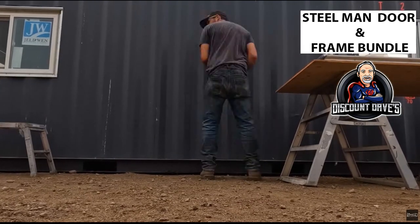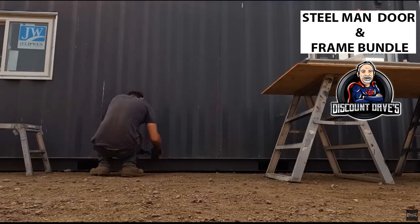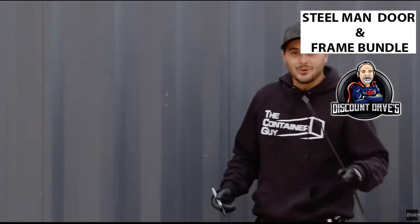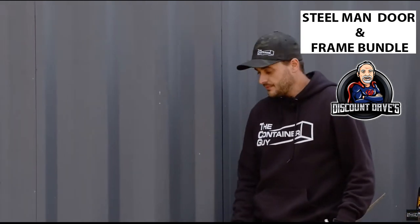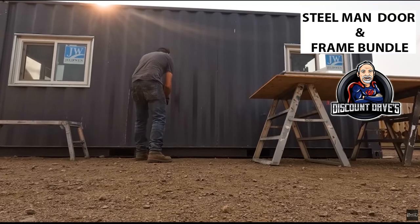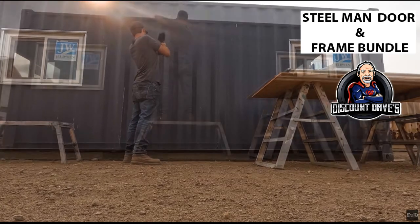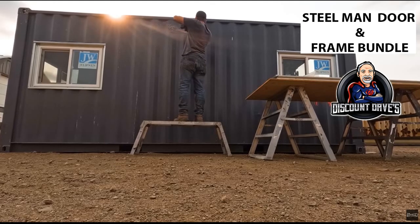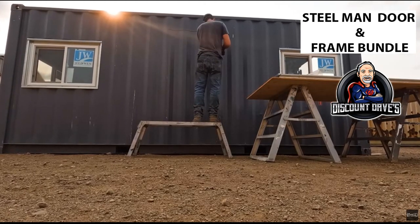And you can control the fall, so you can set a pallet here if there's a big heavy panel and you just want to lift that with your Bobcat or forklift afterwards. Another important thing to note is when you're cutting, if you start by cutting the bottom, then you're not going to bind your disc, your cutting wheel. If you cut everything first and then cut the bottom, the weight of the panel will actually bind it. So always try to cut your bottom first and then go up and across the top, and that's going to be the easiest, the least amount of effort in cutting it.